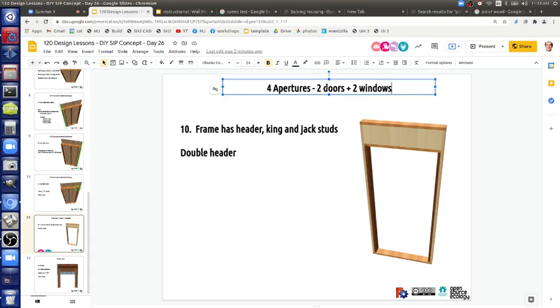Alright, so one other design thing is I would make all doors at least 36 or bigger because everybody needs to move in big things, right? Every refrigerator, every stove, all of those, you're going 30 or above. And that's why we also have the French door that helps some things. Yeah. So let's look at the French door.